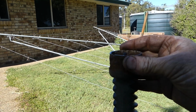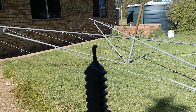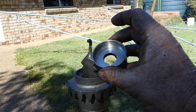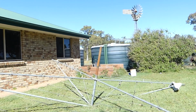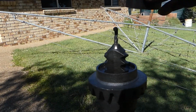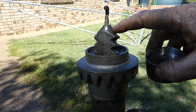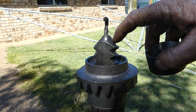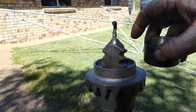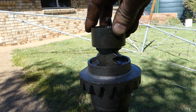Yeah, it could match that shape and away we go, but you know I'm going to have to overbuild it now, don't you? All right, I'll go and have a fiddle, I think. I've turned up a collar, and this should knock on that piece of pipe sticking up on the main beam about there, and it will sit down here, and that's the same taper as this here. Now you can see where this taper here is slightly changed to that one there, and that's just where it's been wearing, I'd imagine. So I've done it to this taper here, that's where the most support is for it.